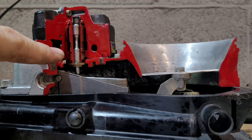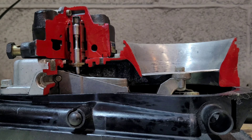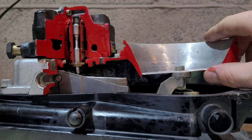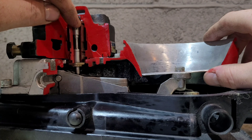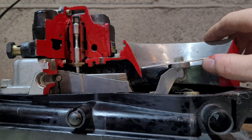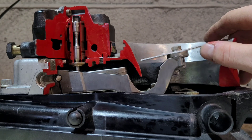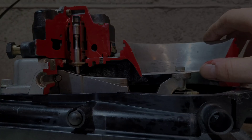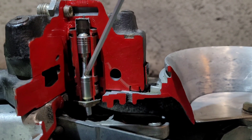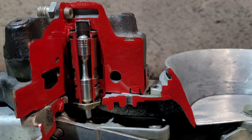The fuel fills all these bottom chambers — this is a bigger chamber and that's the other chamber. When your car's running and idling, this air metering flap moves up, and as it moves up you can see it's raising the pin inside. When you let go, the fuel pressure in the top allows that pin to settle back down. This is our fuel pin, and it sits on a roller which is connected to this arm.